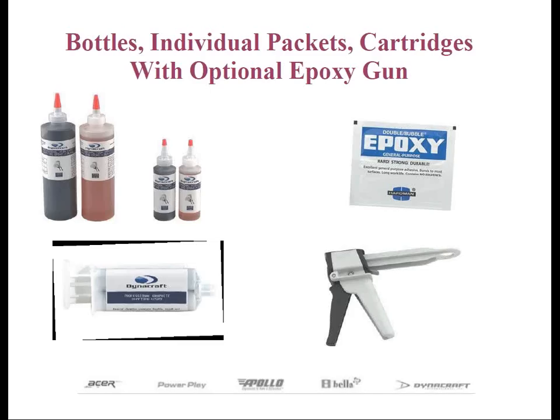Make sure to clean your cartridges before putting the cap back on. There are two tiny slits for the epoxy to flow through, and oftentimes the different colors are visible — like Part A is black and Part B is clear. Just wipe off the opening to avoid contamination, and then put the cap back on by matching the two colors.